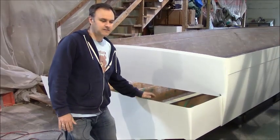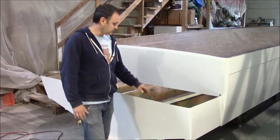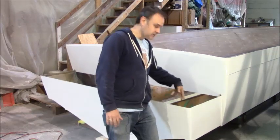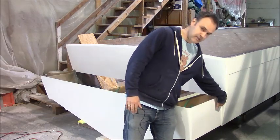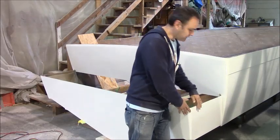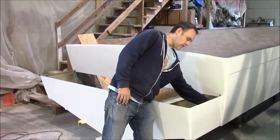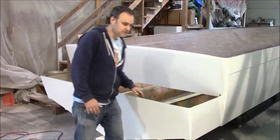I was off for a week and they've got most of it done now. Where we left off was it was pasted in place and the first layer was glassed. They then finished glassing — there were a few more layers in there — and then they pasted and glassed the corner in place. They had to make sure everything was in the right position, then ground a radius on the inside and wrapped the glassing so it's totally tight and sealed.